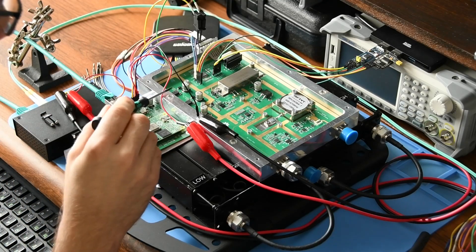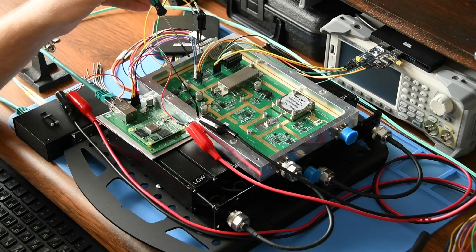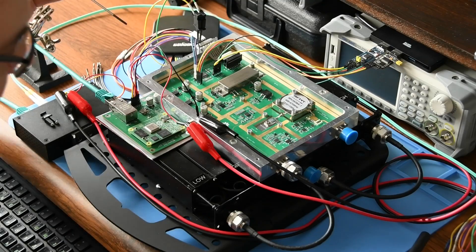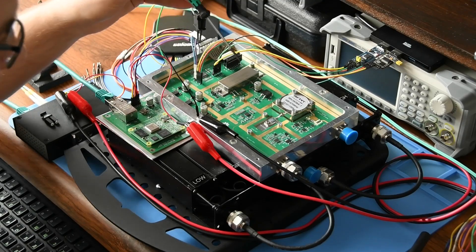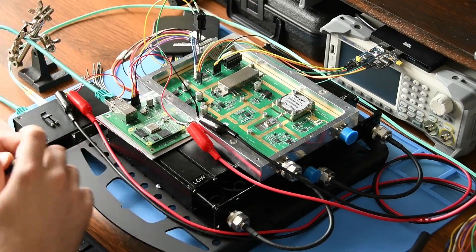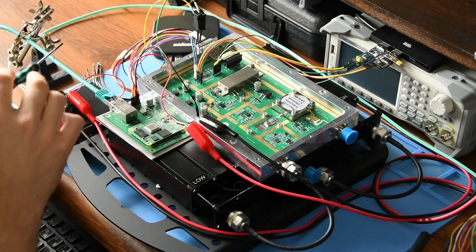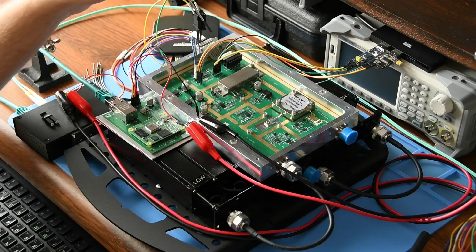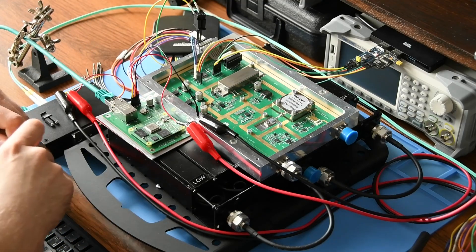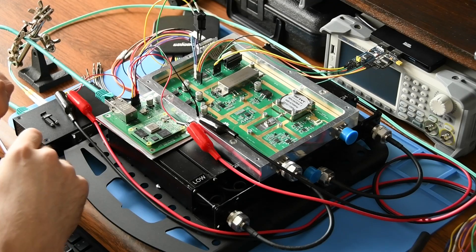Then we've got the STM32 part — that's the logic of the whole device. It controls everything: both the transmitter, receiver, automatic level control, and also the SWR bridge and the power amplifier. It also handles all the communication between the remote radio unit itself and the external world. That protocol is called Common Amateur Radio Interface, called CARRI for short. That's our own design as well.